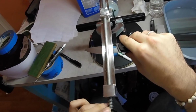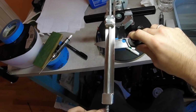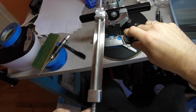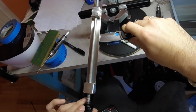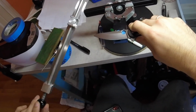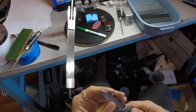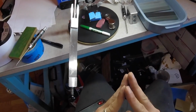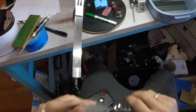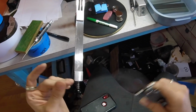Okay. With the strop, I do recommend doing the thing where you slightly go this way, towards, put the pressure away from the tip and just come right off. Go like this. Okay. So you're going to take the burr, any burr off of your edge, and it's going to clean it up and really bring the keenness out. And that's going to be important for your edge health, like we've been talking about. Very important.